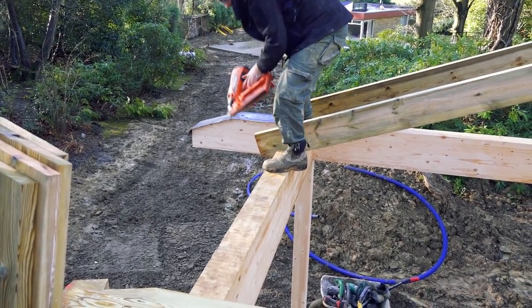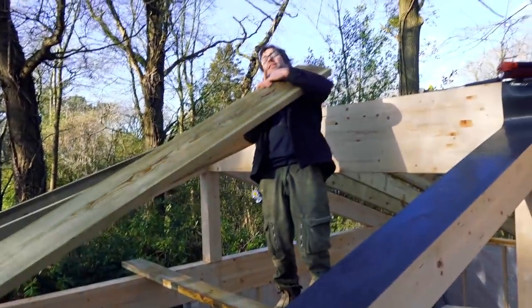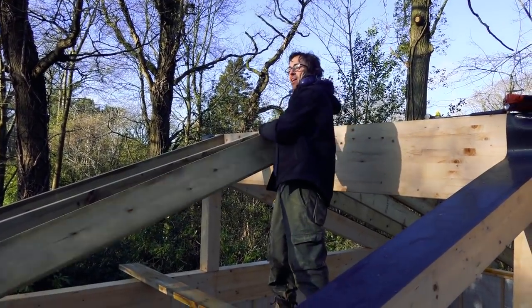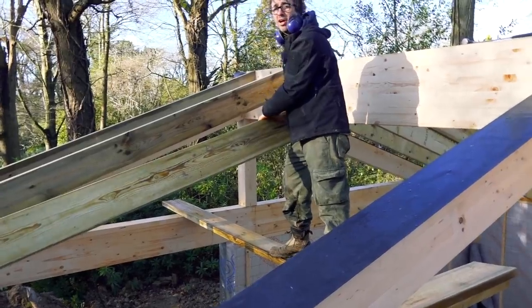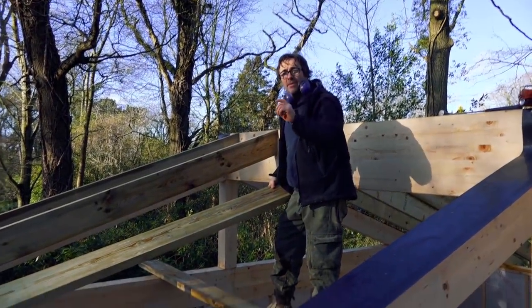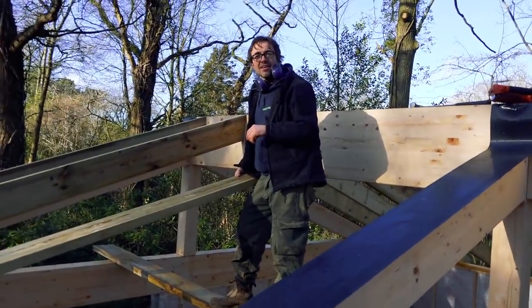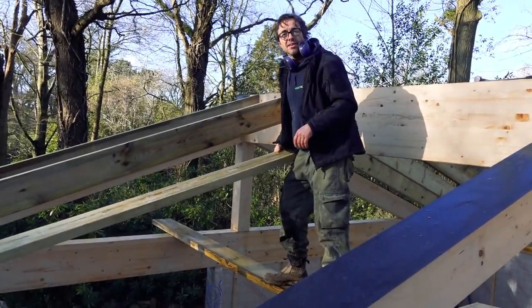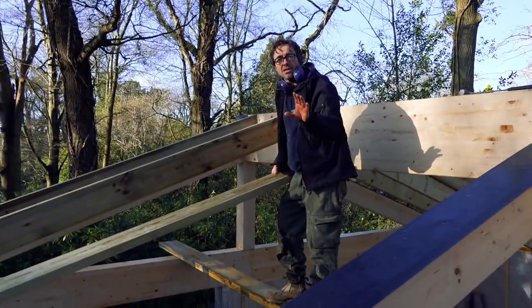400 centres? 600. They look closer, but that's because they're bigger timbers. I'm actually spacing these at two-foot centres, which is slightly more than 600. But it means I haven't got to cut all my sheets. I've got a 52-sheet supply — I can probably put 24 or 26 full sheets on here without any cuts. The work is in the cutting.